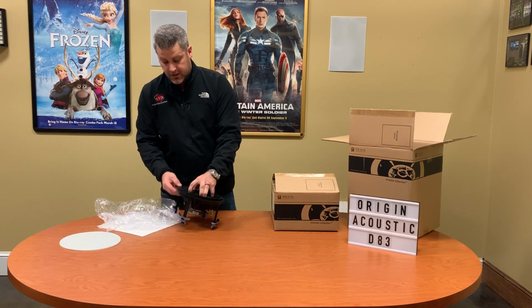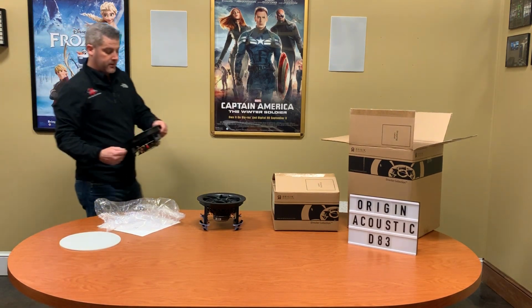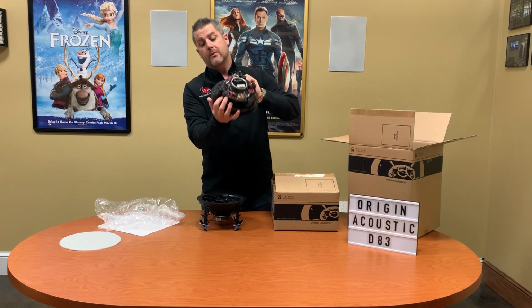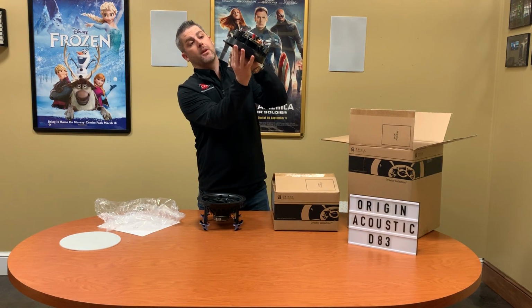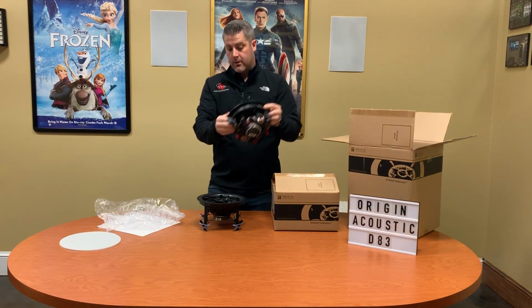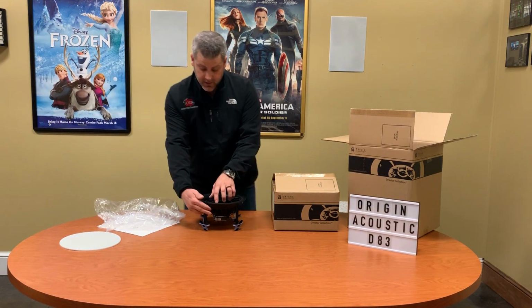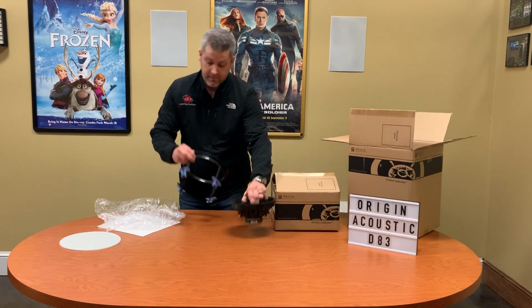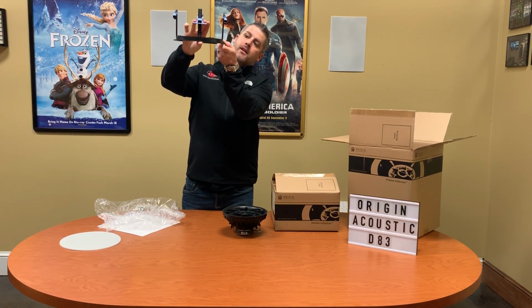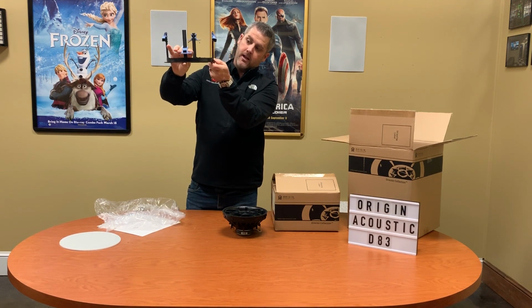So that is really, really slick because it keeps you from having to do this. Let me show you here. This is another speaker. The old school way was these dog ears. So you would actually have the speaker going up into the ceiling, and you'd be up there with a drill, and you tighten it down, and it smashes into the drywall to hold it. So we'll get that guy out of the ceiling here. What this one does is when you want to go put it in the ceiling, you got your hole cut, you slide this guy up in, you reach up in here and pull down on it. It's got these spring and teeth tensioners that lock it into place.